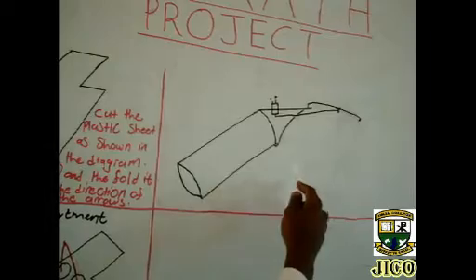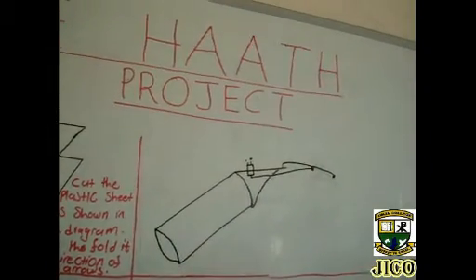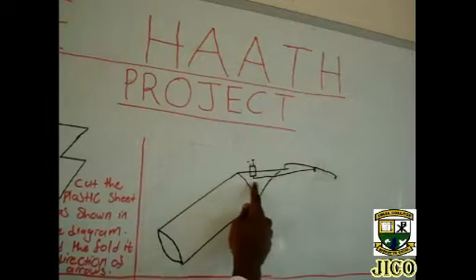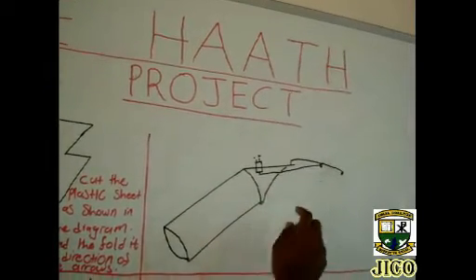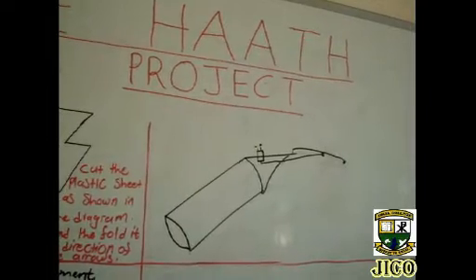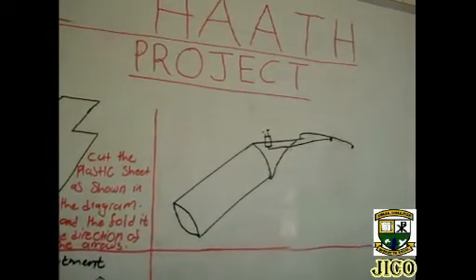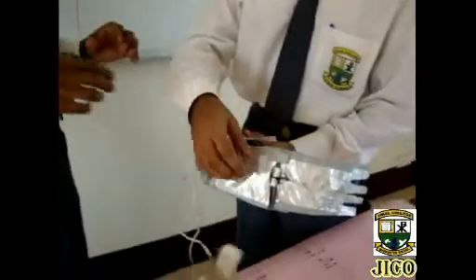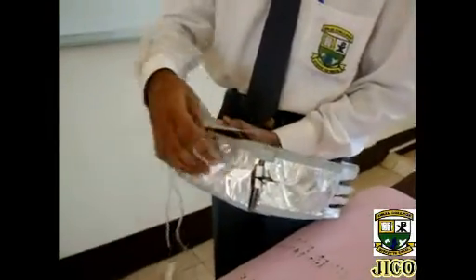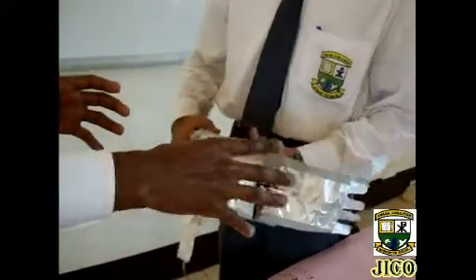This is an outlay of the finished piece with the motors attached. As you can see, this is a string from the motors running up to the gripping part. When the circuit is connected and complete, the motor rolls and pulls the gripping part closed. Behind it is a rubber attachment of a certain tension — this tension is measured exactly so it has just enough to pull the grip back open when you disconnect the circuit.